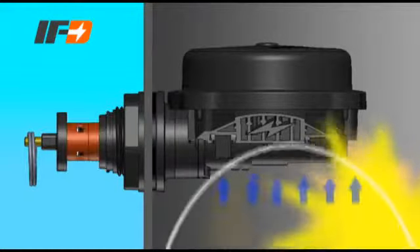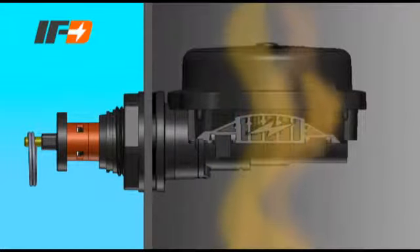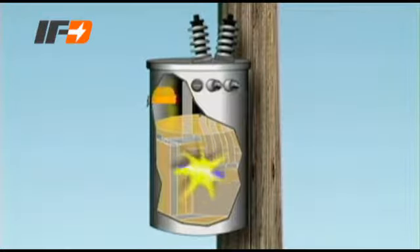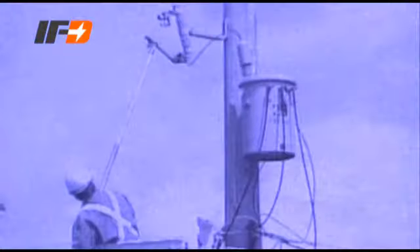When a fault occurs, there is a sudden increase in tank pressure and gases collect in and above the oil. A fault can produce several types of gases that when mixed in particular proportions can become explosive. The explosion seen here is an example of one of the hazards line workers may face when re-energizing transformers that have an internal fault.